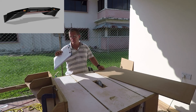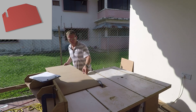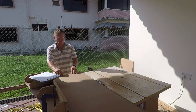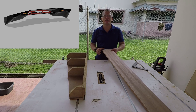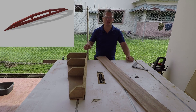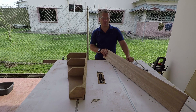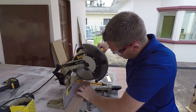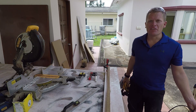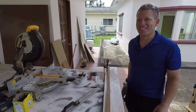Just about to cut the lower glare shield assembly — that's what the EFIS units sit on. Now the rear frame is actually quite complicated; it's got five different angled cuts on it. I've set the table saw to the first one, which is just to set the slant that this goes back towards the MIP. I'm two angled cuts down and I've got three more to go — hopefully I won't cock this up.